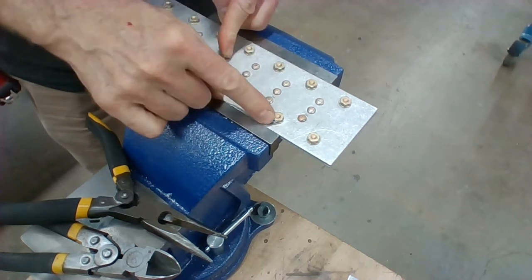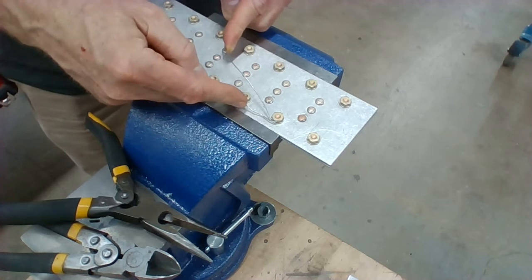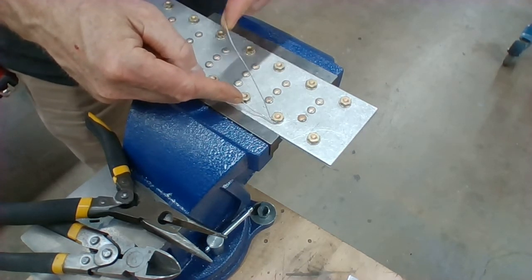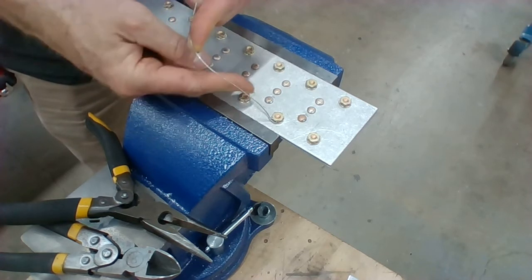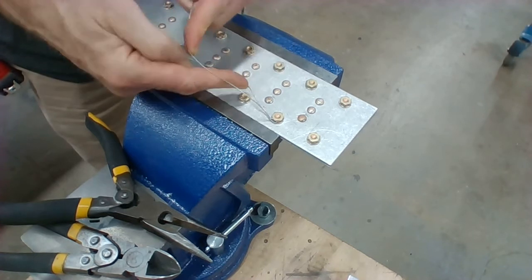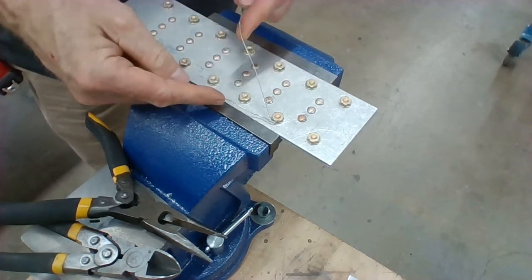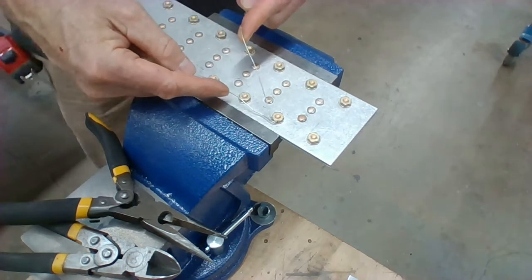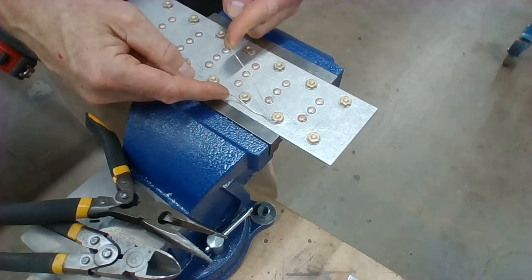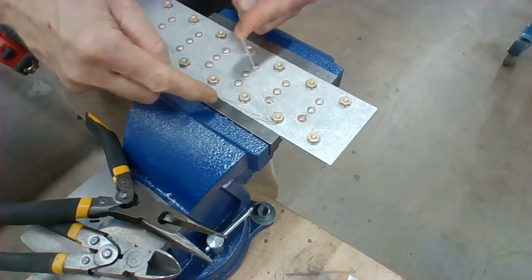As I come out of the bolt, there are procedures as to how to start wiring. I'm going to take my left over and my right under — that's the pattern I'm going to do the whole time until I get down here and feed it through. Left over, right under. I'm trying to get roughly six to eight turns per inch, and the thickness of my thumb is about an inch.